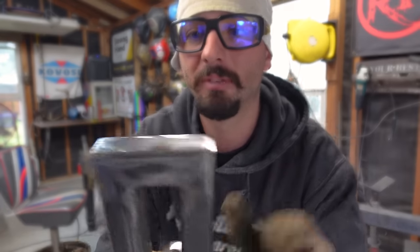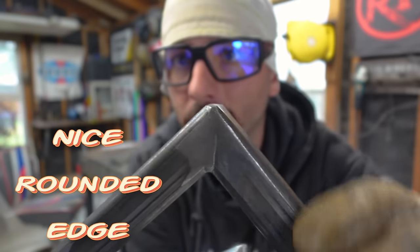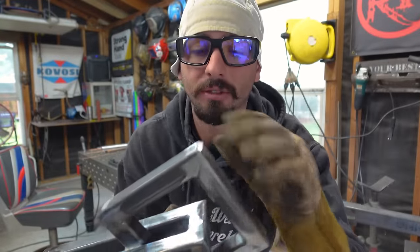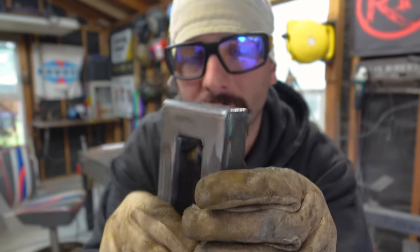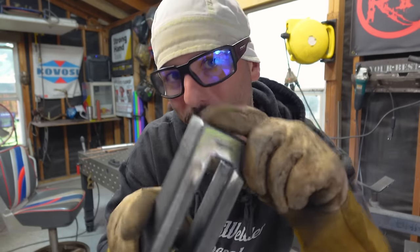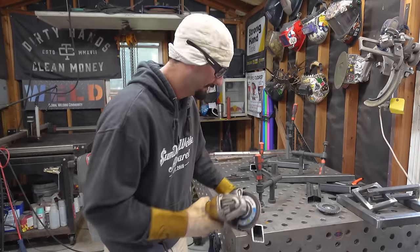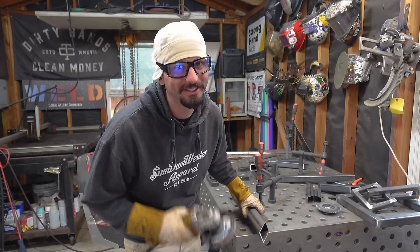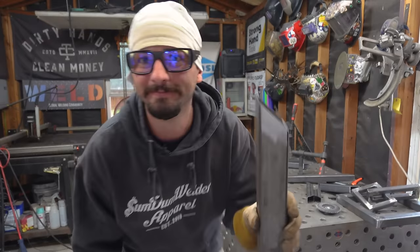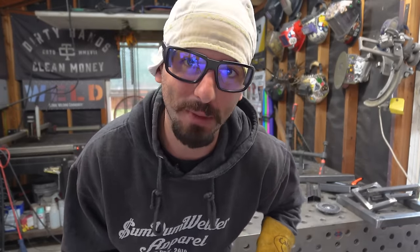The biggest difference between those two corners is the difference between having a nice sharp edge after finishing versus a nice radius of an edge. This is for the more structural stuff — a weld that gets a nice corner-to-corner. It'll still weld fine on the other three sides, so it's not structurally much less strong, maybe just by a hair. We're going to go for these sharper corners today. Don't be the welder that doesn't prep their material — grab a grinder and hit all four sides. Anywhere a weld touches should be nice shiny steel. That one step can make your welds that much better.